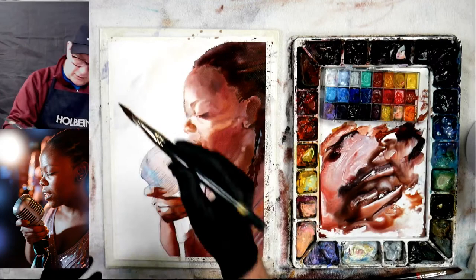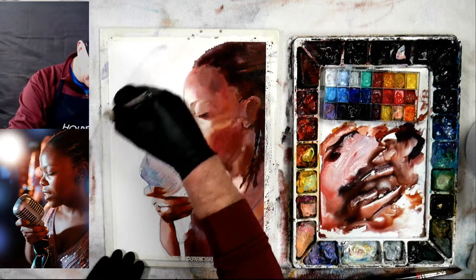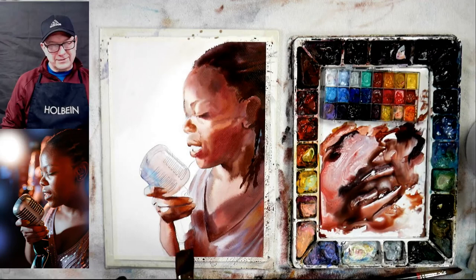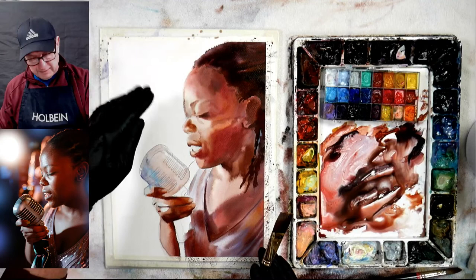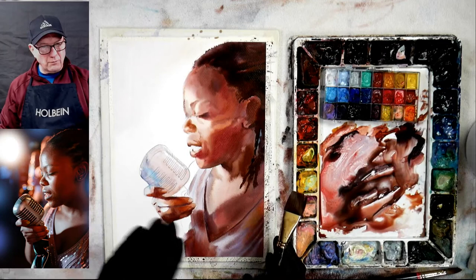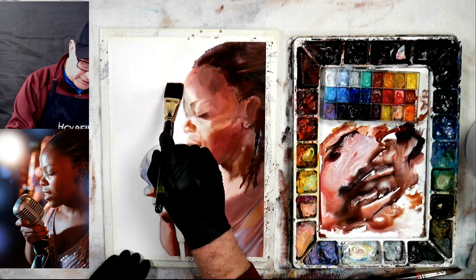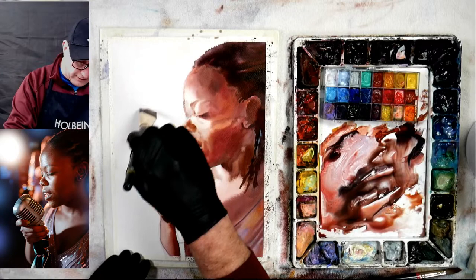Maria says there are a lot of people who do glazes and keep going over and over. You can do it, but each glaze has to let dry first because if you don't let it dry it's not going to look as fresh. Anytime you put down paint, make sure it's wet in the wet. There's no putting down a little glaze in just an area — you have to re-wet the whole area because if you're just doing parts and constantly putting a tint, it doesn't look smooth. You cannot glaze parts and pieces — you've got to do the whole area, and each glaze you put down you have to make sure the previous one was fully dry.